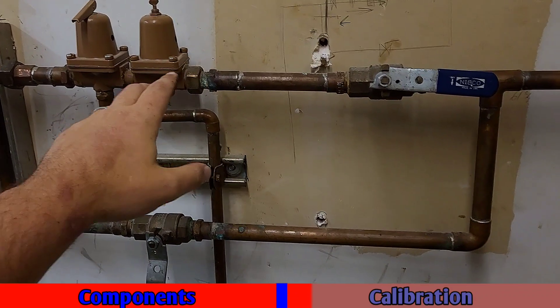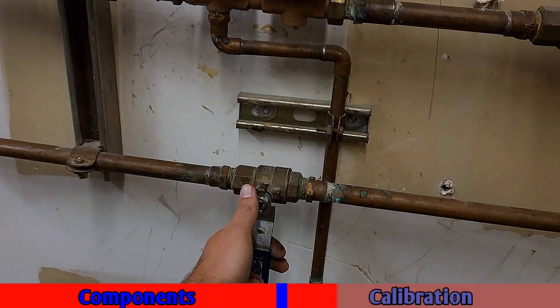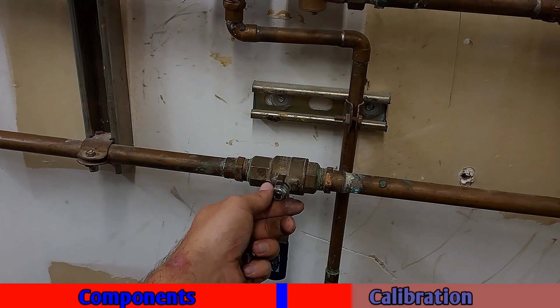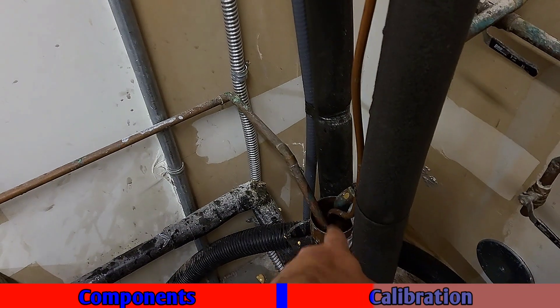It was out of calibration when we got here — we did not have enough water in the loop. I used the bypass, quickly got water to the loop and filled it up to just above where I wanted it to be. It was about 12–14 psi by accident. I was able to use the relief and verify that it worked and it's not leaking after I used it.